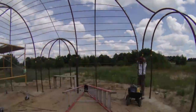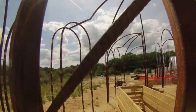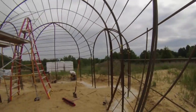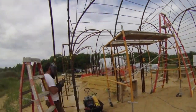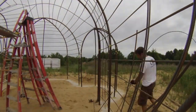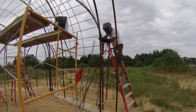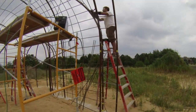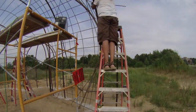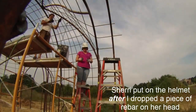Then I mounted my GoPro to a rotating cooking timer and started having a bit too much fun with panning shots. Here Zach is starting to drill holes to place the vertical rebar while I'm still welding the horizontal so we can climb safely. I curved each vertical piece to the right shape and then just dropped it in the hole so it was ready to be tied in. More welding of the dormers, and this area above the master bedroom was a bit tricky to shape properly. Sherry took care of most of the rebar tying while I was bending or welding.